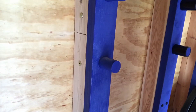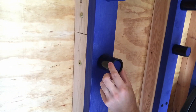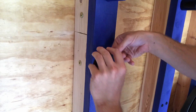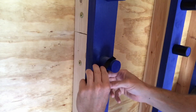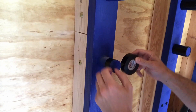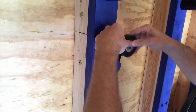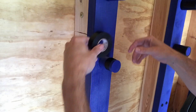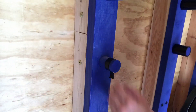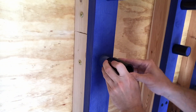The one-and-a-half inch PVC fits a little loose on the one-and-a-half inch dowel, so you're going to need to wrap the dowel with electrical tape. By my count it'll be about five-and-a-half wraps of electrical tape, and when you put it back on it'll just take the play out of it.